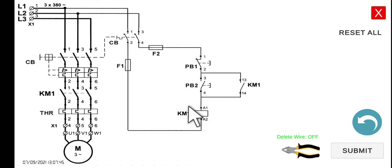At the same time, if the coil is in an energized state, the normally open main contacts here will also close. So if these main contacts close, the current can now flow through those lines going to the induction motor, which will in return turn on the motor.